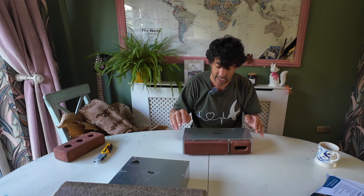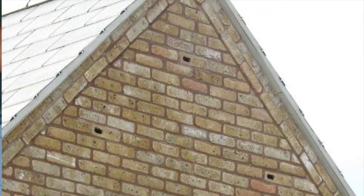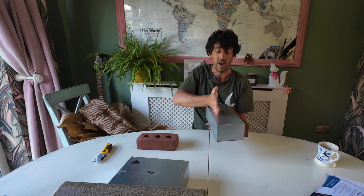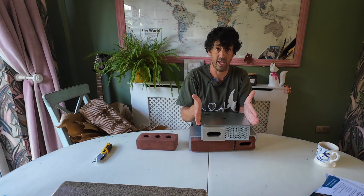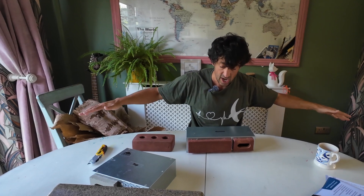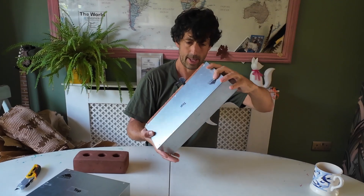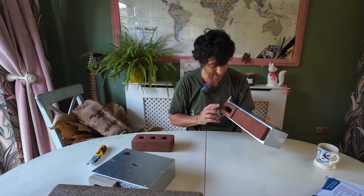This box is slightly longer because it gives the bird more space — it takes up one and a half bricks. You can get that laid and color-matched as well, so it's nice and easy for the bricklayers. It's gone deeper rather than wider, to give the swifts enough room. Baby swifts will actually do press-ups within the box to build up their wing strength before fledging, so it's really important they've got a bit of room in there. There's a nest cup in there as well.